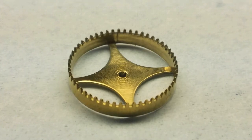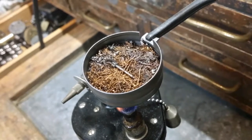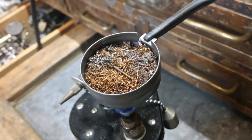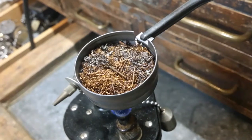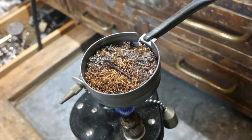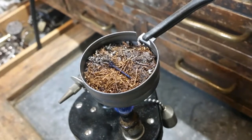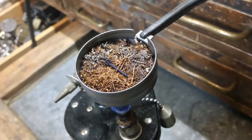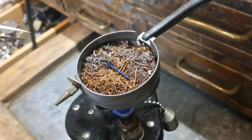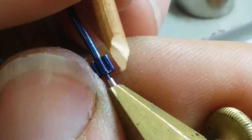You can see there that the inside was not as polished as I would have liked it. I failed to film the hardening process, but here we're going through the tempering process and you can see the color change. If you go back and look, the first color would be white, then straw, then bronze, then what they call peacock, then purple, and then finally blue — which is where we want it to be.